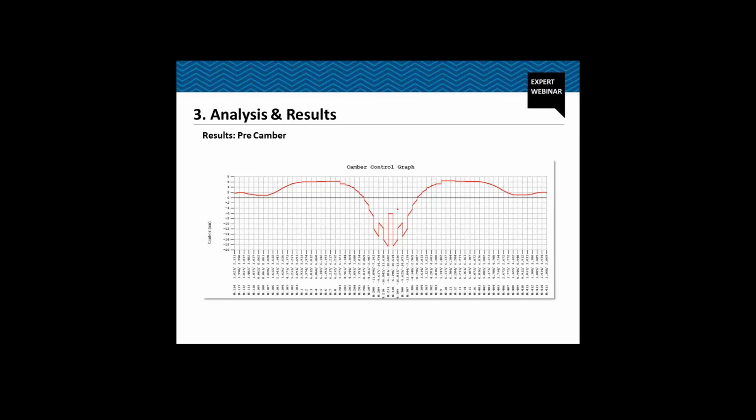So that is why we are casting the stitch segment, or actually other segments as well, below their level. Because under the effect of the creep, the tendency of this zone will be to go upward. So after the desired time, let's say after 20 years or maybe 30 years, we'll have the perfectly desired layout of the final profile. This zone will come down, this zone will go up.